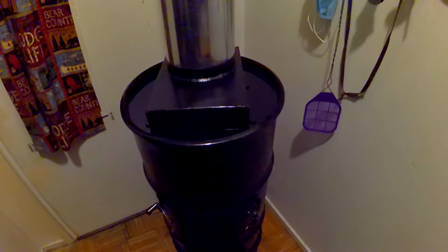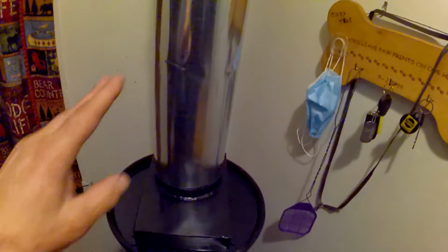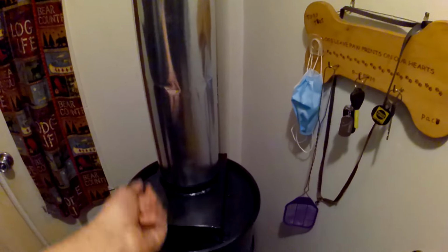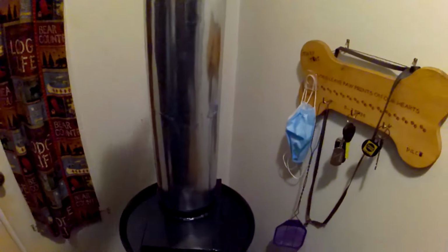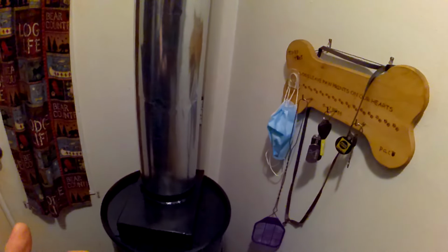So that's also cut off another barrel. And let's get into this. So I got a 6-inch flue. Very important stove tip is I've incorporated a damper here. You want that at least 3 feet above your unit because you want that draw. You want that under fire to over fire draw going through it, so that when you want to put wood in the stove, you can just open up the damper, get that draw going, and you won't get a face full of smoke or anything.